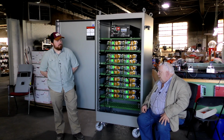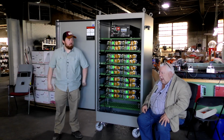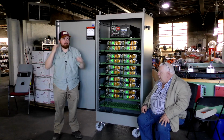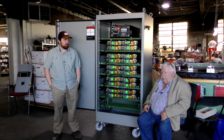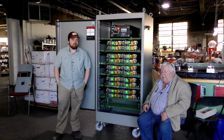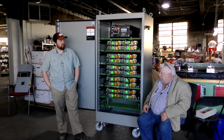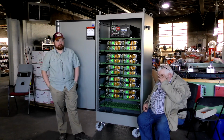Well, that's crazy. And they're calling them AC modules. This is going to be how solar's done, really from here on out. You're going to get AC power from your roof, and that's why we've been on and on about AC coupling into battery storage. And I've gone over several reasons why.